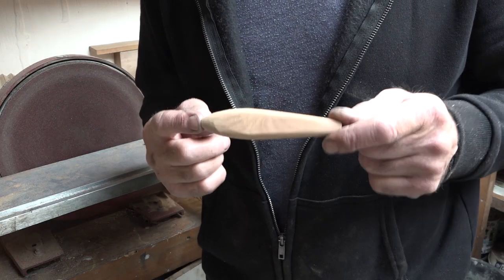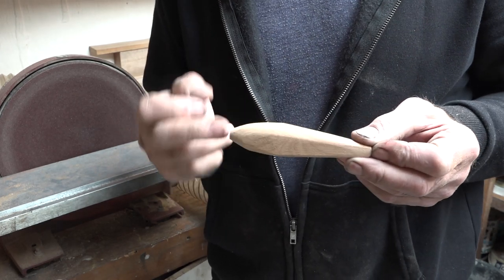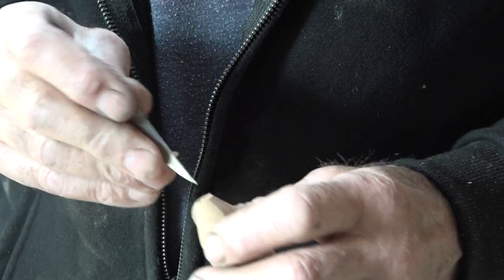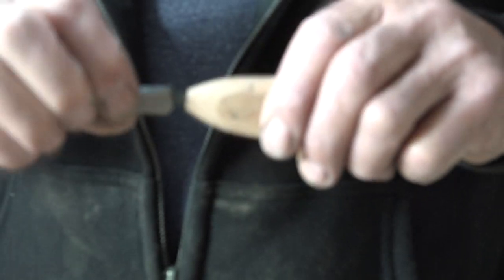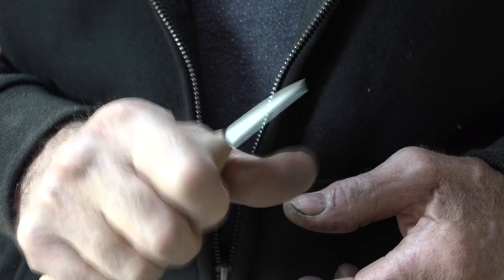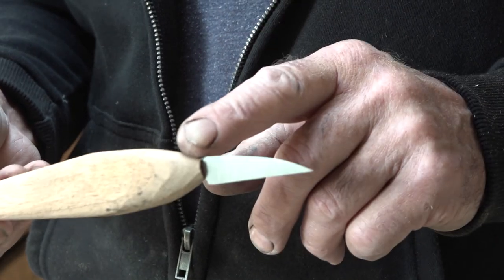It doesn't take long and that's kind of where we've got to — like a little minnow bait. Just elongate the end where the wider part of the tang goes in, or just run a drill bit in with your cordless — it's going to take one of these almost perfectly. Just really comfortable — whichever way you hold it, it's just a nice grip, just the right length. You can fit it into the back of your hand, hold it and get very precise little cuts. So that just wants some epoxy on it now.